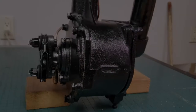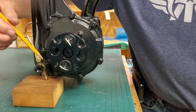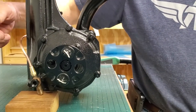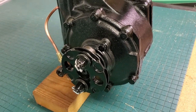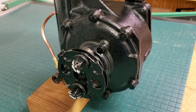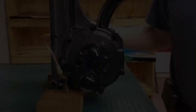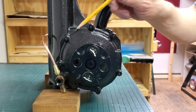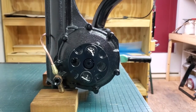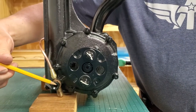This is the correct way for your assembly to be — the correct line size going up to the top. Do not enlarge this copper line size. If you enlarge it you get too much oil at the top and you'll put oil into the supercharger. Do not change what they've done originally. This is your input coming directly from the block, and this is where your oil sender must be put. If the Graham engineers wanted the oil sender here, there's a really good reason: if no oil goes up this line it takes just seconds to destroy the top of the supercharger. Locate your sender right there — there's no reason to put it somewhere else on the car.